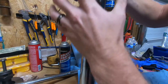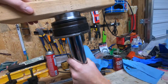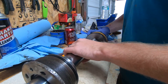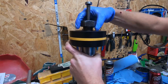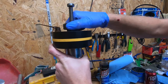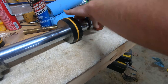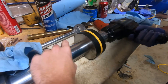Now we are on to reassembly — we will be putting the gland back on. We just put a ton of grease on it and then beat it on there with a 2x4 and a mallet; once it gets on it'll actually slide down quite easily. When you're putting the bolt on, the manual calls for loctite, but I'm just going to torque it really tight and not loctite it so it doesn't get stuck. I thread it in by hand just to make sure it's got a nice tight seat and the threads aren't crooked. The rod at the end should be able to actuate, then I'll put the socket on — that's our three-quarter inch drive ratchet — and we're just driving it tight before we hit it with the impact. That is the large Harbor Freight three-quarter inch impact and we just hit it a couple times to make sure it's tight.